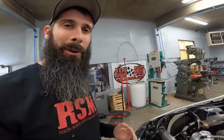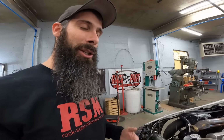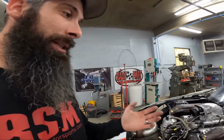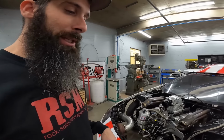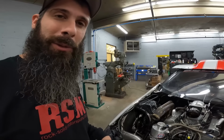So it's allowing the header to move with the engine pulses or the fires of the two-step and allowing that pipe to go in and out of that double slip. Well, the hotter the stainless gets, the more it's going to come out, and eventually it's going to get where it's misaligned and just start pushing further and further out. And looking at that, that's exactly what has happened with this setup. Regardless of the fact the collectors are starting to swell up and we're going to switch to billet and stuff like that, it's just the perfect storm for the pipes to spread apart like that.